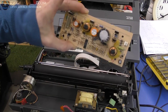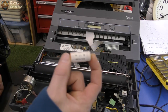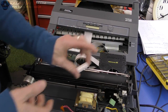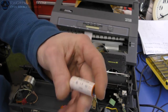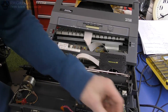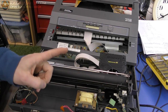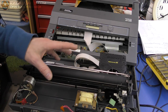I did find a problem with the main power supply — I fixed it, and then it broke again. It's probably never going to work because there was a battery in here that was probably holding some memory in check on these circuit boards. Some of these may be flashed, and if you lose power, that's it — it's gone for the life of the product. Unfortunately, this battery is dead. I bypassed it, plugged it in, and hooked up the right power to the right pins: 5 volt, ground, 12 volt, 36 volt — unfortunately no go.